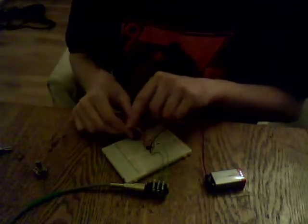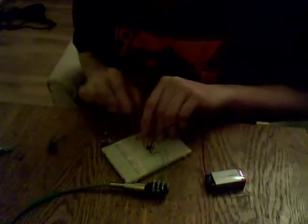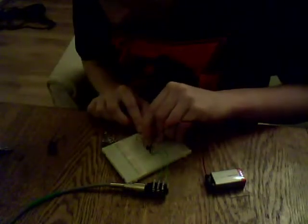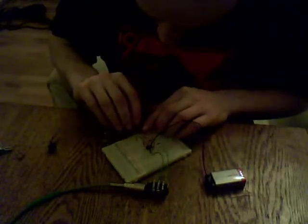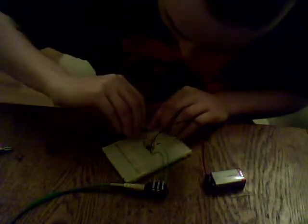You can get some much lower pitches out of it. It's quite nice. So what you could do is, let's say you've chosen the 10k or 1k or whatever, and you want to change the upper limit. You could take a fixed value resistor — like this is the same as the one that you get with the kit, it's a 1k resistor. I just pop that in there with the variable resistor. Then you should change the upper limit of it.